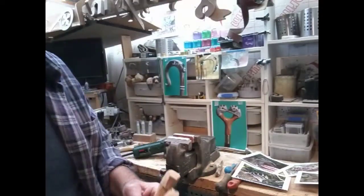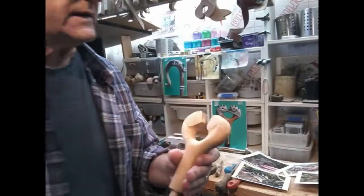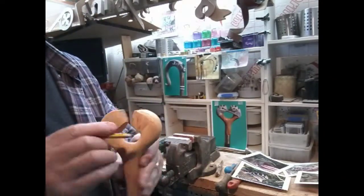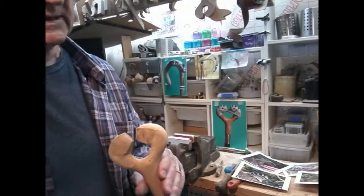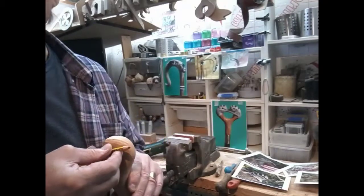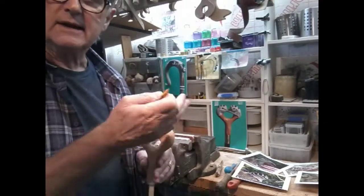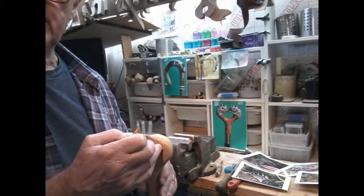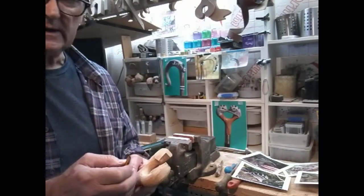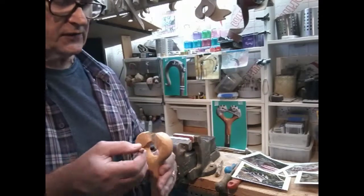So that's not bad. Now, what I've always done with these is that as you come across there, that beak lies against the opposite head. And I've always put a wee bit of a, let's call it a channel in there for the opposing beak to lie in. Now, there's a good reason for doing that.